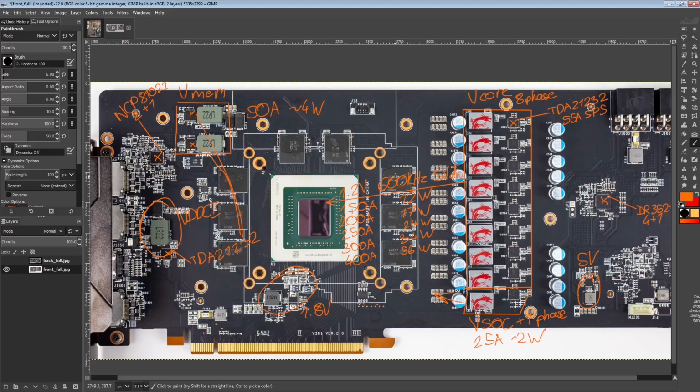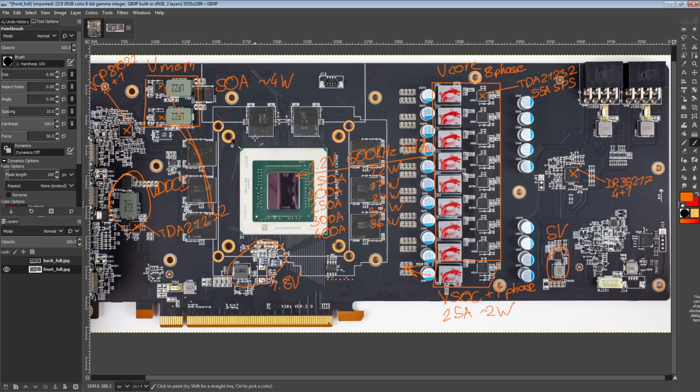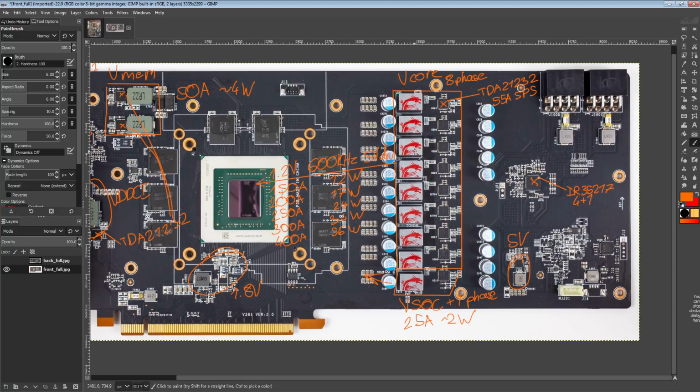So you might want to buy the RX 5700 Gaming X from MSI and then flash the 5700 XT Gaming X BIOS onto that, just to get a little bit more performance, a bit more power limit, that kind of thing. And this doesn't have dual BIOS, so if you screw that up, you basically need to have a backup GPU. Which is a little bit less convenient, since a lot of other 5700s will just give you dual BIOS. On some cards you can at least see where the BIOS switch would go, but here there were never any plans to have dual BIOS on this card at all. So that's the one thing I would complain about here, but at the same time, BIOS flashing is not that dangerous and not that risky unless you're modifying the BIOS yourself.